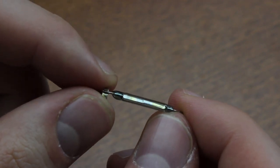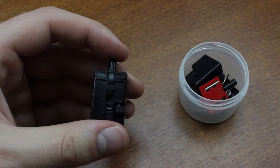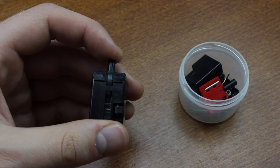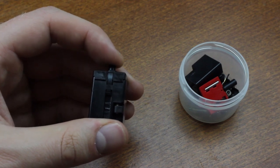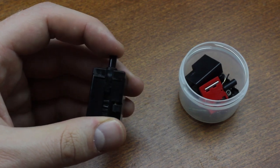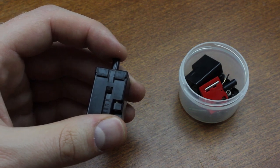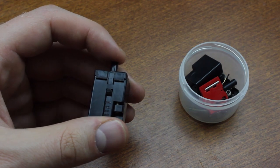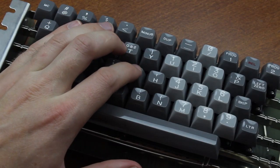For anyone wondering, the movement of the contacts itself doesn't wear them out because the motion is below the fatigue limit. Furthermore, the advantage of using a magnet is that the switch becomes contactless, which considerably enhances its potential for smoothness. This is also why I've been such a proponent for contactless modern switch alternatives that employ hall effect or optoelectric switches.